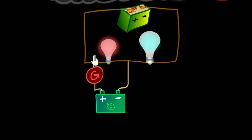Let's think about the potential difference. Here we have some potential difference — this is the positive, higher voltage side because it connects to the positive terminal of the battery, and here we have some lower voltage. Let's call that lower voltage 0 volts to keep things simple. All I need to figure out is what the higher value is. If it's, say, plus 2, then the potential difference is 2 volts. Now, since the other end is directly connected to the negative terminal of the battery, we can also say that point is at 0 volts.